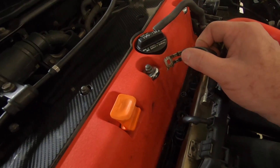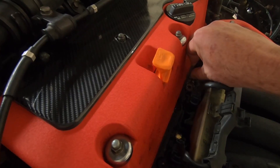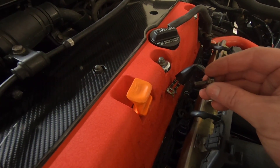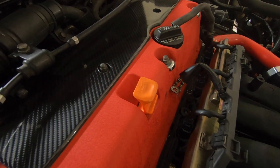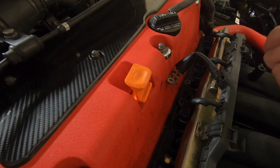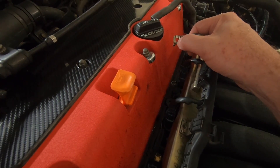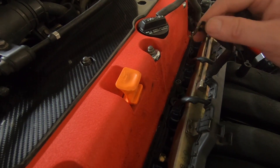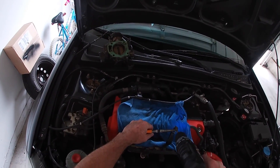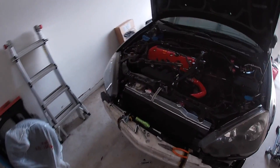Quick little update — I didn't know about this one. That part right there is supposed to go in here, and it does fit physically, but the hole it's supposed to go into is 10mm and the one we're supposed to be using is 12mm, so it doesn't fit. I'm thinking maybe I can try to drill a bigger hole, or try to separate this part so that way it will work.